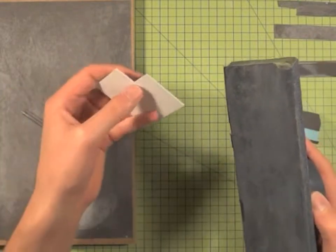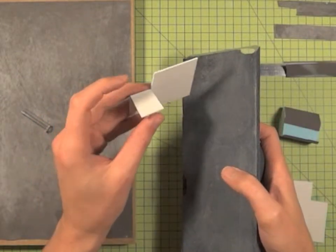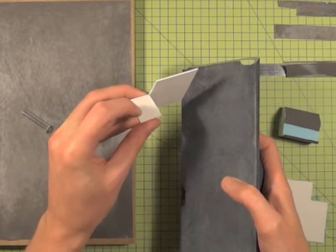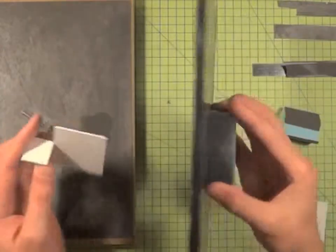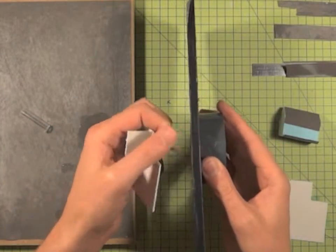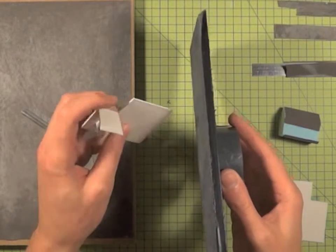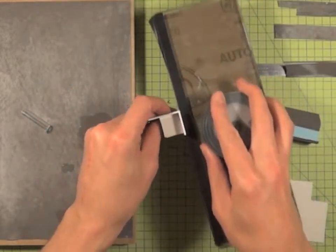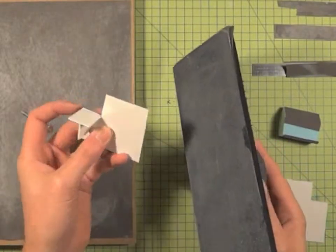So let's say that I've got a different example here where I'm wanting to sand this edge, but say on the other side of the 90-degree I'm wanting that not to get scuffed by the sandpaper. So what I've done is put a bit of insulation tape down the side, and that means that it's far less likely to scuff the nice clean visual face, but it means the sandpaper can still go to work on the other side. So I could work it like that and I should get a pretty good result.